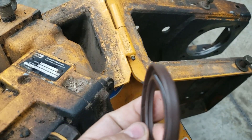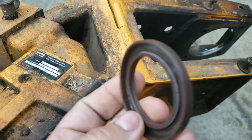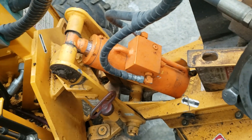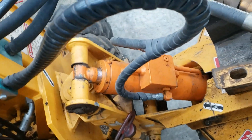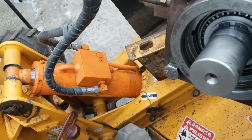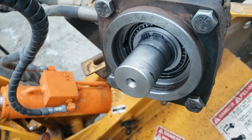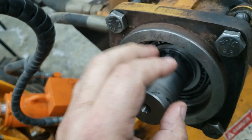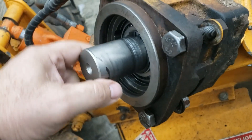I went down to my seal supplier here — they do a lot of oil field stuff. They said this is Viton. They did not have it in Viton, otherwise they could have replaced it for me. So the only place I could get it was from Bandit. I ordered it, came in about 3 or 4 days later. I don't mind $130 to fix this pump — I'll make that back in a couple hours of grinding. That's part of being in business. Viton is not regular rubber — it's made for heat resistance and solvent resistance for oils and hydraulic fluids. That's why the seal had to be Viton.